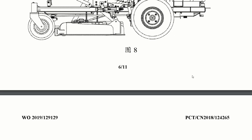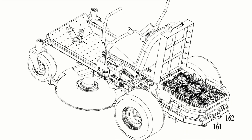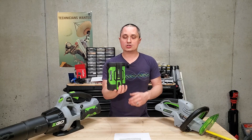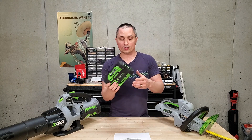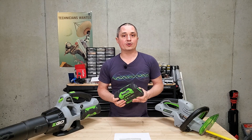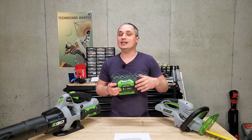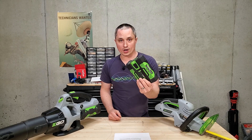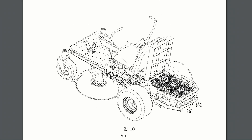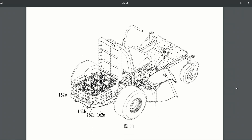It's going to be able to run off of less than six as well. The patent specifically says five banks of parallel cells. So this 2.5 amp-hour battery has one bank of cells. You can run it off of five of these, or you can run it off of one 7.5 amp-hour and one 5 amp-hour — any combination that adds up to five sets of cells in parallel. The minimum size battery Ego lists on this patent is 130 watt-hours, which is a 2.5 amp-hour battery for them.